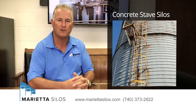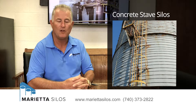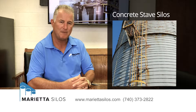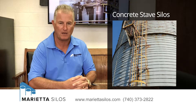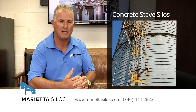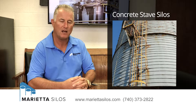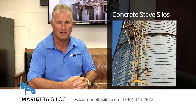There were varying manufacturers that built those staves throughout the United States. However, those stave silos are held together by what we call hoops, which are typically about a nine-sixteenths diameter steel rod that is wrapped around the silo and then tensioned. There can be many of those hoops around the outside of the silo — you might have 50 hoops, you might have 200 hoops. So if you have a concrete silo that has a series of those hoops around the outside of it, that is a stave silo.